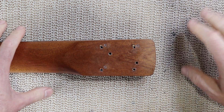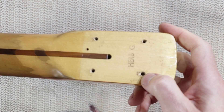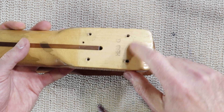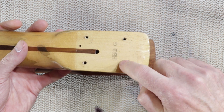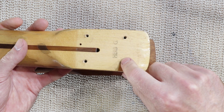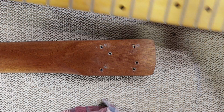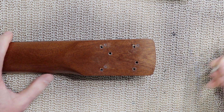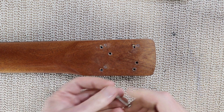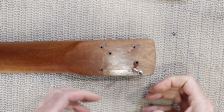This is a common problem with vintage Fenders. Here's another neck from the 70s - I can just push my screw straight into this hole; there are no threads left at all. It's kind of on its way to happening with this one too. Since these are the two screws you'd remove completely when adjusting the truss rod, it's much more likely to happen on the front two screws. By reinforcing the threads with CA glue, it's much less likely to happen. You'll find the screw - especially if started by hand with a screwdriver rather than a drill driver - is much more likely to find the original thread and follow it.